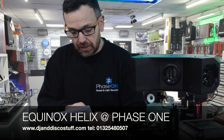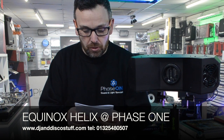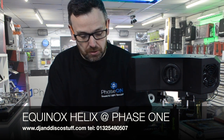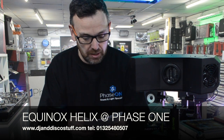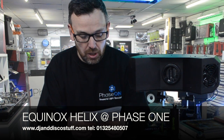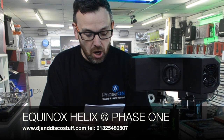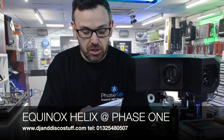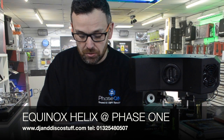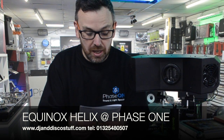Now let me tell you, show 0 is everything, yeah? Show number 1 is all gobos in all colours, including split colours. Show 2, slow mode, non-reactive to sound, yeah? Show 3, all gobos and colours, excluding split colours. Show number 4, all colours including split colours and all gobos, excluding snowflake and hearts, so we can leave them out. Show 5 is all colours excluding split colours and all gobos, excluding snowflake, hearts and gobos.